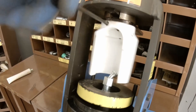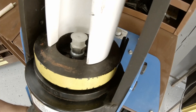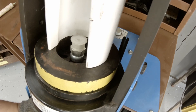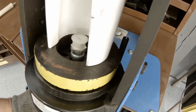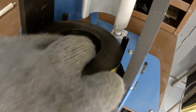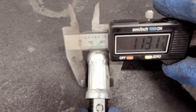Now I'm ready for my spacer. We're going to turn on the crimper and leave it on until that spacer bottoms out — we want to make sure we get a good crimp. It looks good. Now to verify our crimp, we're going to measure the diameter of the crimp and compare that to the crimper's specs, and it looks good.